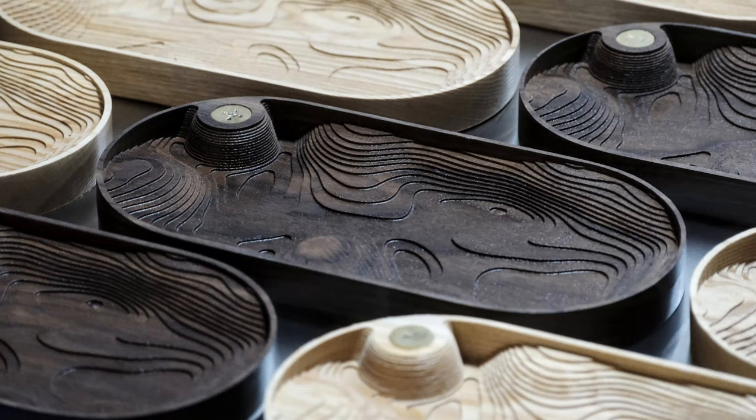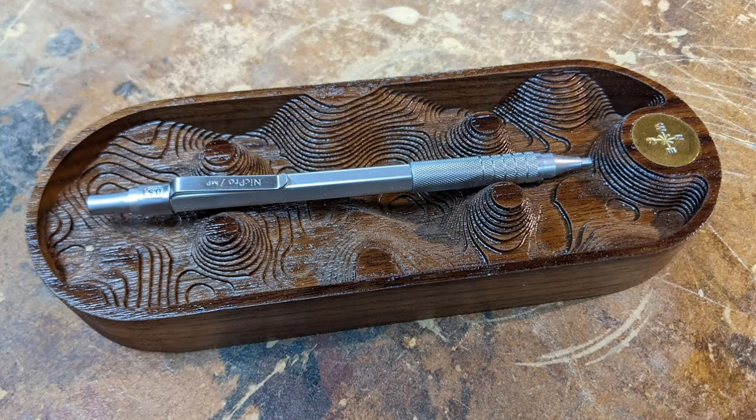I only went over pieces that fit inside a blast cabinet — mainly stuff coming off a CNC — but if you look at large table manufacturers like Restoration Hardware, that's exactly how they're doing their finishes, just blasting in a much bigger space. Different types of wood give you different types of finishes, but if you want to take away your mill marks and get a nice finished product without 30 to 40 minutes of sanding, sandblasting is the way to go. In my shop, everything I've sandblasted finishes extremely nicely — mainly with film finishes. Thanks for stopping by the shop, and I hope everybody has a great day.